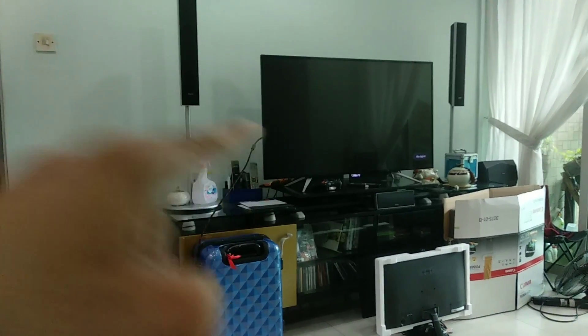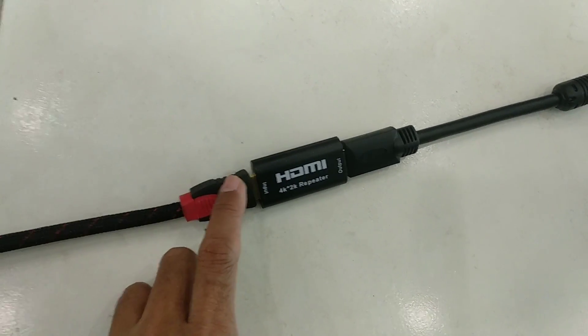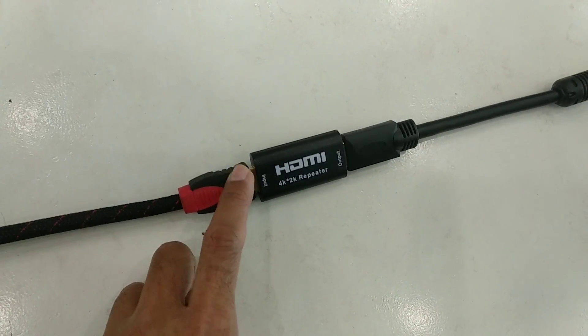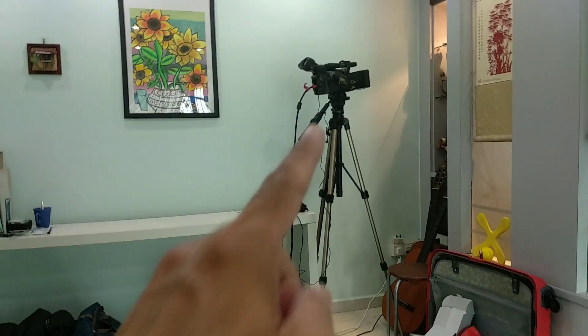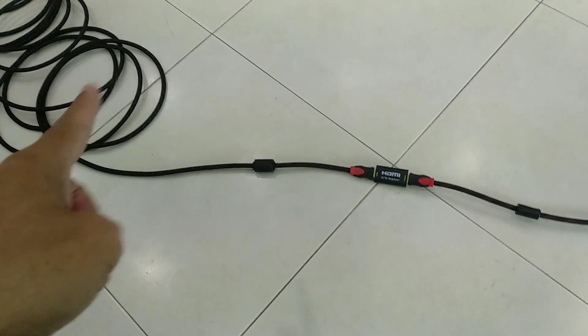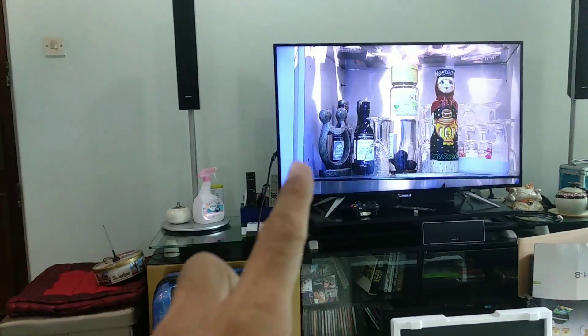No result. I am not pushing 4K — just simple full HD from the camera. In conclusion, you can't count on the non-powered HDMI repeater to extend your signal. The best you can do direct from the camera is 10 meters on one end — the shortest side — and 20 meters on the other end to the external monitor.